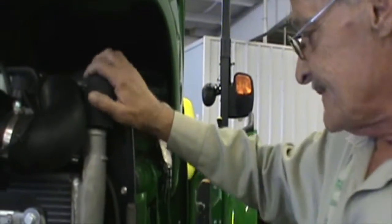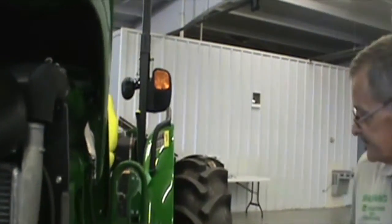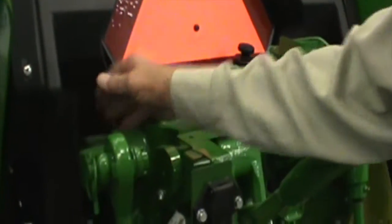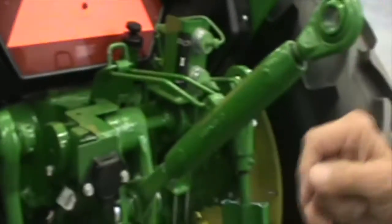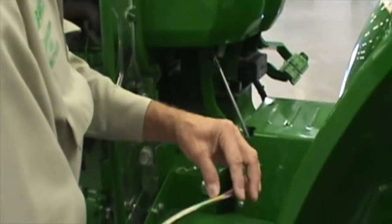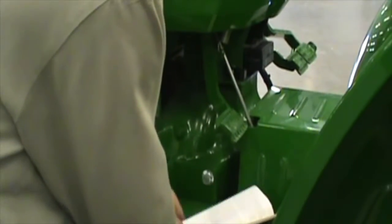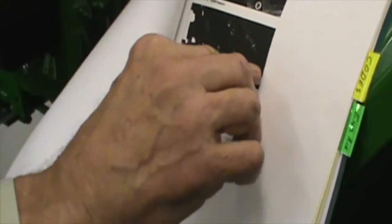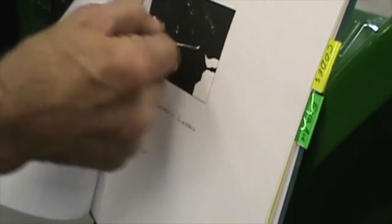The second bug we have introduced is back over on the rock shaft. The lift arms — the complaint is they won't come all the way up; they only come half the way up. Now, on the front side there's what is called a feedback linkage. In my tech manual there's actually a dimension for that feedback linkage. This is the feedback linkage — it's connected to the rock shaft arm, so when it comes up, it moves it back and forth.